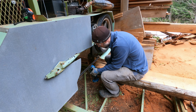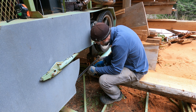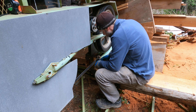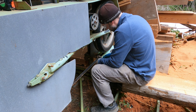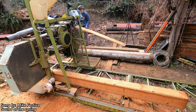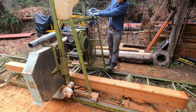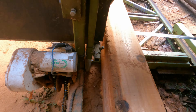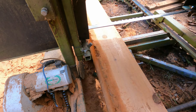This is an old blade I had on all winter long and the teeth were a little dull. You can go back through and just touch the teeth up, keep the angle — it's good for one, two, maybe three sharpenings like this. The blade's only like $22 for this sawmill, so if I can get a few resharpenings out of it by hand, it's well worthwhile. Right here I'm just milling a bunch of cedar for this cabin — some is going to be siding boards, rough cuts, kind of a rough-cut board and batten, and then some of the other stuff is going to be window trim boards.